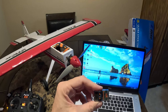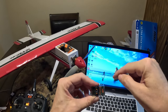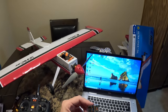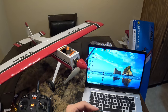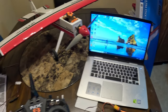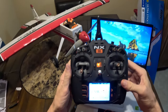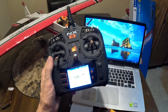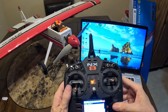Now let me show you what's cool about this. You can do this to a receiver that's already on the plane if you want to clean it out and start fresh. I've already bound this receiver to my radio, so let me show you something very interesting. With the receiver flashed, jailbroken, reset, and unlocked, let me show you what's changed on the radio. When you go to Forward Programming, you'll notice there are two menus: one that says 'Gyro Settings' and one that says 'Other Settings.'